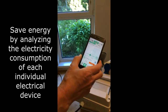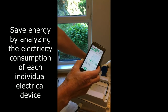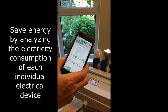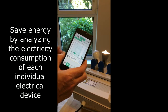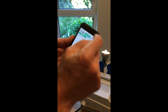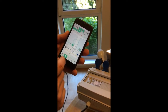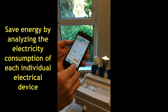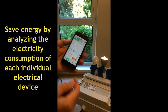I'll switch it off and want to see if it comes again. After three such training actions the analyzer shall recognize it. Two of them have been done before. We can see below on the yellow bar that there is already some good recognition, and we can confirm that this has been recognized properly. This gives you the ability to assign all the power usages of your home to the different devices.